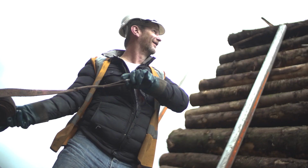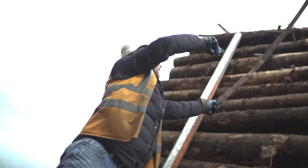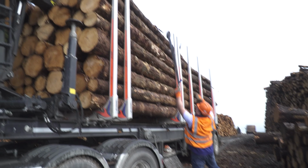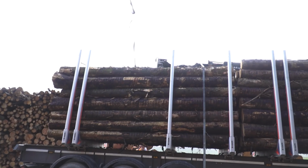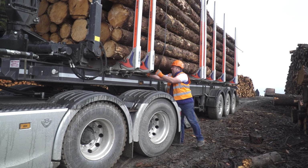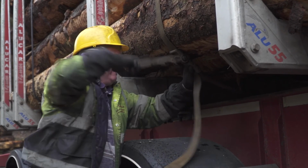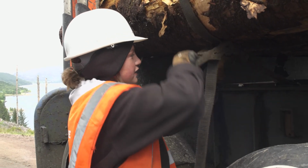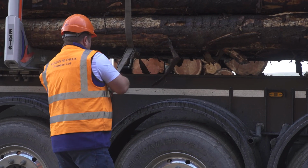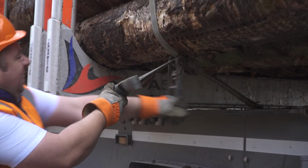Always check your load straps and tensioners before use, and make sure that your straps are legibly marked and labelled. Check the straps for any tears, cuts, nicks or breaks in the load-bearing fibres. Always replace straps that are substandard. Where possible, straps should be fixed to a vehicle in a manner that prevents them from sliding under severe braking. Otherwise, they should always be securely attached to the trailer chassis. Where you use any lashing points, they should be of adequate strength and be suitable and convenient for attaching the end of ratchet straps.